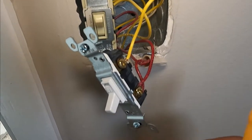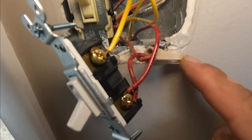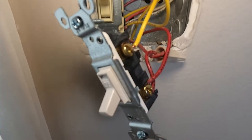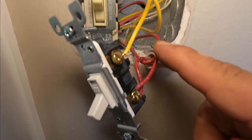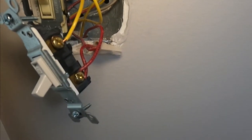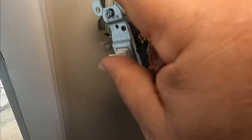I just took it apart for you to see. Pay attention to the red wire by the wire nut — this brings the power from inside and then it comes to the switch and loops in the switch, then goes to the outlet. It is the one on the left. Because this power is not passing through the switch, it's constant on — constant power to the left side. This is the switch leg, so when we turn it on, the yellow wire is going to have power. When we turn it off, there's no power to the outlet.